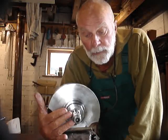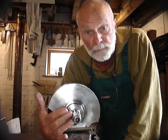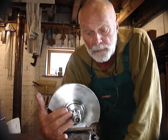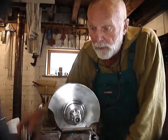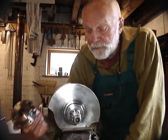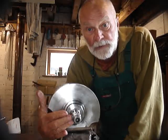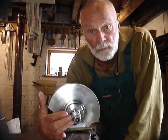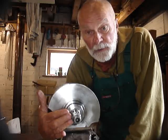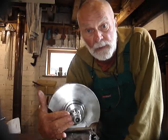The situation we have on this one is that it is a tight fit, and if it's not sufficiently tight it will rattle loose. I've had quite a few failures from trying to supply an item which will fit straight off the shelf, so I've had to stop doing that. What I supply now is a hub which is a tight fit and needs to be fitted correctly. If your shaft is undersized due to wear or prior failure, I supply undersized hubs which have to be hand fitted — meaning you take an item off the shelf that won't go on, and you file away material until it goes on correctly.